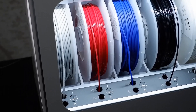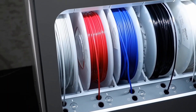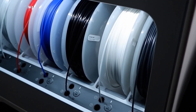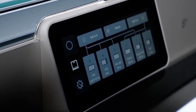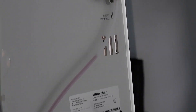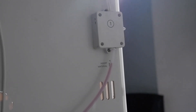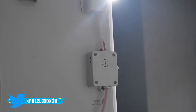Front loading of material is a huge step toward better ergonomics, doing away with loading from the back. It also knows when a filament is loaded and detects the type of material by NFC, so you don't have to worry about material configurations. The UI is also updated, showing you the materials available within the station as well as their paths toward the print core they are assigned to. The feeders for the Material Station are also made of hardened steel, making them ready for printing composites such as carbon fiber and glass fiber. The Material Station also shows up in CURA and CURA Connect if your Ultimaker S5 Pro Bundle is connected to the network, allowing you to see the various configurations possible with the loaded materials.